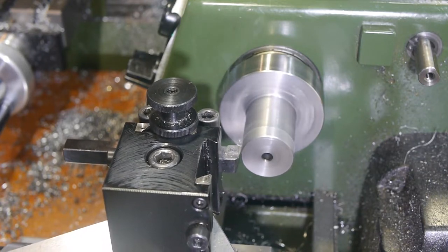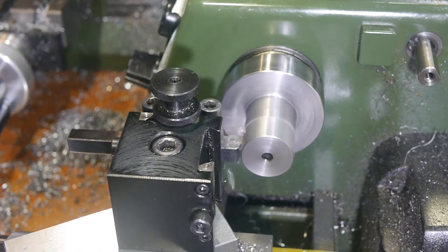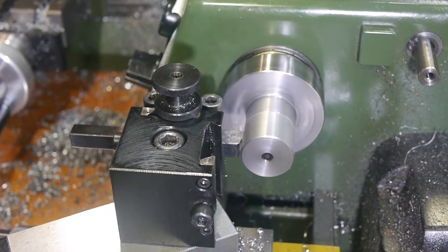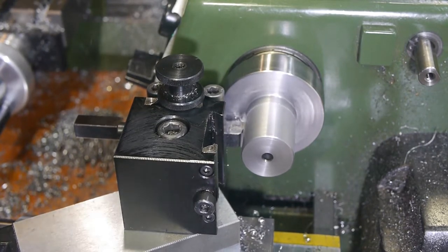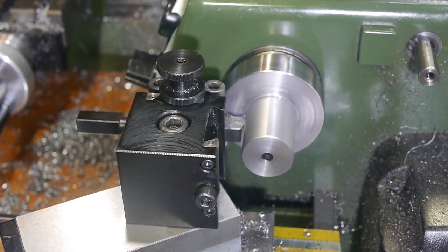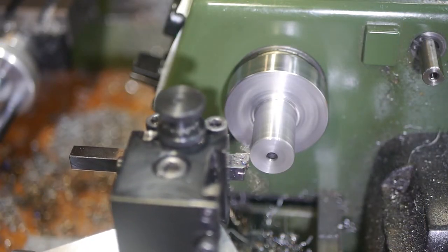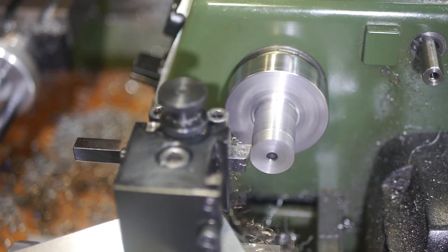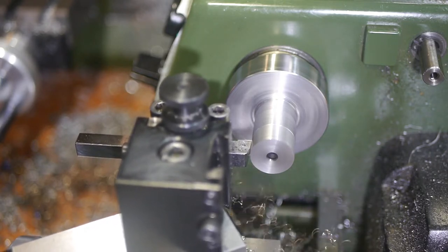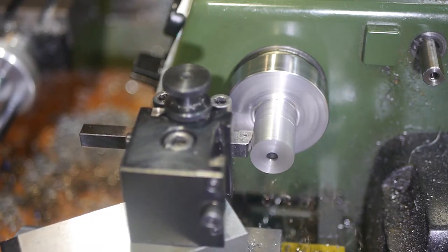My design specifies the central shaft diameter is 14mm, but I'm inclined to use a larger dimension for a couple of reasons. Firstly, the faceplate has a 6mm hole bored in it, which doesn't leave much surrounding material for screws to secure to the shaft. Secondly, the material for the shaft has proved difficult to machine and shown signs of work hardening, so I'm nervous about attempting to tap narrow threads into it. I opted for a diameter of 18mm so I can fit 3mm tapped holes comfortably in the available material.